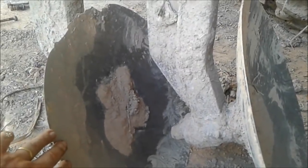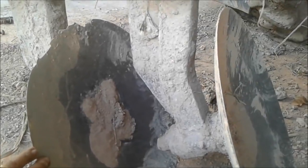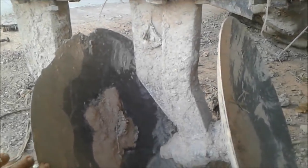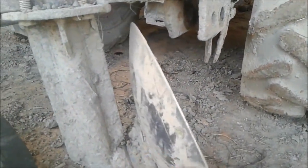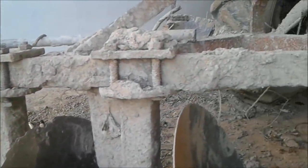They're supposed to all be evenly distributed on the depth, but I've noticed when you look out the back when you're plowing that this is the most shallow one. You can see the angle now, but that's because I've taken the back bit off. I've got adjusters on here but they're pretty much seized up, so even those have been fixed in place.